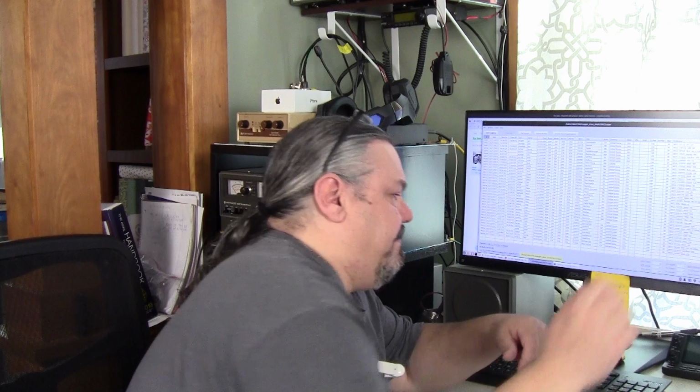Now, with that being said, the functionality of both the ICOM and the Kenwood is great. The ICOM is a little bit more user-friendly for CW as a radio, simply because the filtering is narrower. It's also a radio that allows me to adjust how wide the filtering is, which matters in a crowded CW world, like this past weekend, when we had the RTTY contest going on, as well as an SKCC event called the Weekend Sprint. That's a once-a-month event held by the SKCC, or the Straight Key Century Club, of which I'm a member. So having a really narrow filter was nice, because I could zone in on those CW signals without listening to a lot of adjacent signals bleeding through.